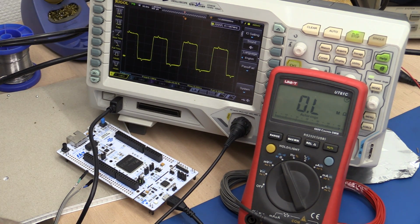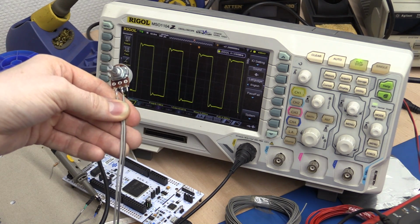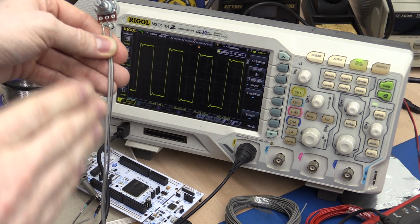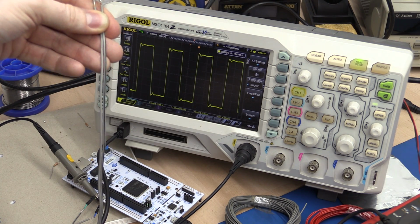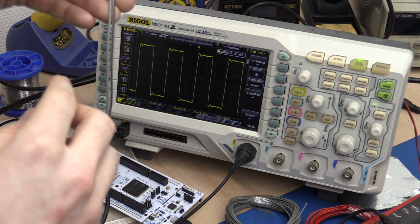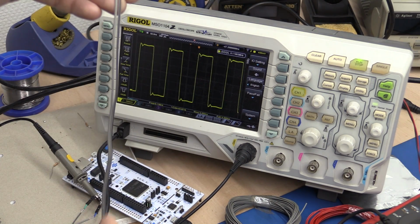You can see it's not as nice, but it's pretty good. So there is another thing that I would like to demonstrate also. Remember I said that this transmission line has to have a uniform characteristic impedance, and that means that, roughly speaking, it has to be one cable without any connections, and it cannot be damaged in any way, and it should have the same shape.